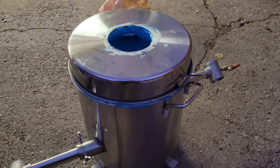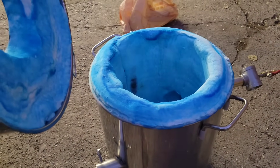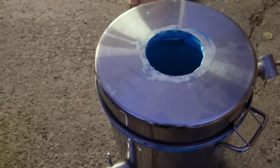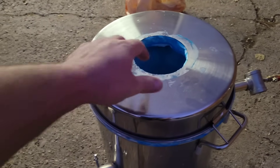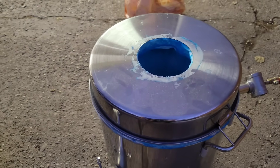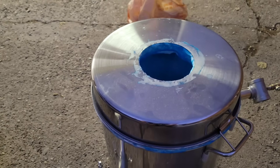This foundry I got is just kind of a cheap one I found on Amazon that's lined with kaowool. I've taken it and covered it in rigidizer that I dyed blue just to make sure I could get it everywhere. It looks like it's got most of the stuff pretty well — some places look a little less — but I think I put maybe too much on it in most places. These lighter places are still pretty stiff with it and it's essentially just fumed silica mixed with water. That's put on there to make sure the ceramic blanket — which is made with really small ceramic fibers that when it gets into the air acts a lot like asbestos — is protected.